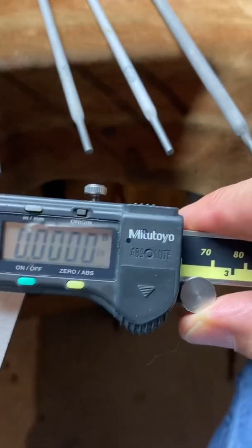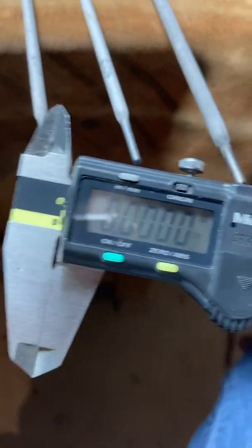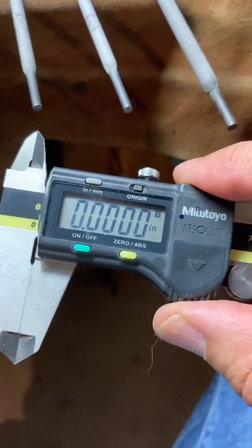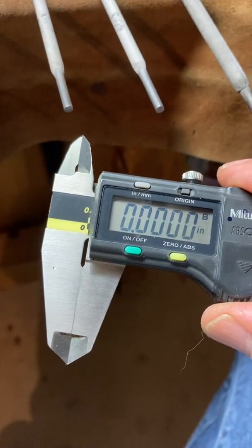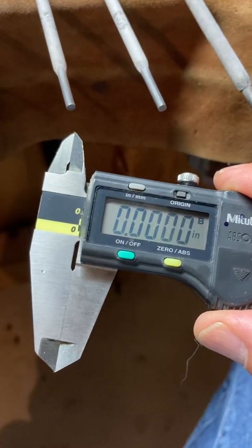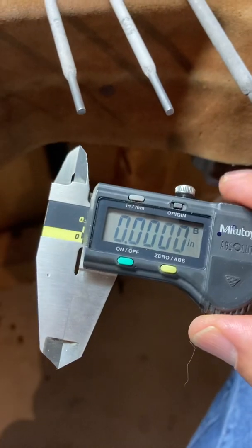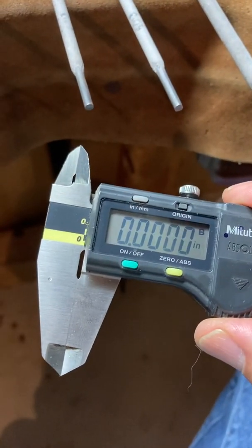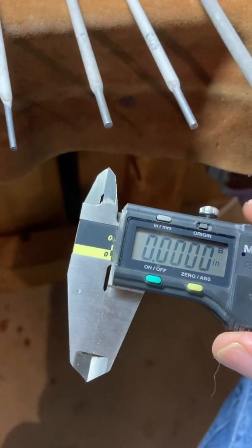This is why. I'm going to take my digital dial caliper here, and the base thing you want to use is this: you base your amperage on a simple rule of thumb. We've had some of those so far about bead size. This one is on amperage, and you base it on 1 amp per thousandth of an inch of thickness.